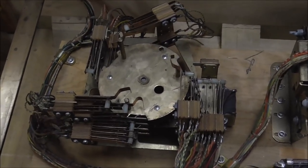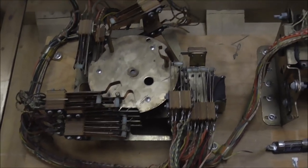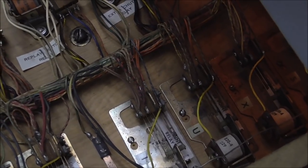All right, so that time it gave us 60 points. Did you see what happened? It gave us 20 points, and then it almost let go. But then it pulled in again and gave us another 20 points and another 20 points. So why is that? What's it doing? It's because there is a switch on this motor that, when it turns two revolutions, is supposed to open up to kill the power to that relay. That's what's going to happen.